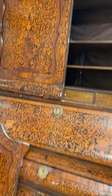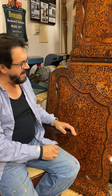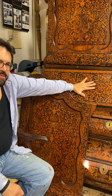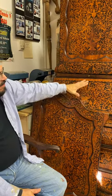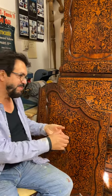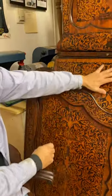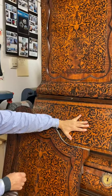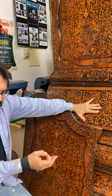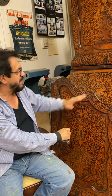The seaweed marquetry was one of the most intricate of four or five different marquetry styles done in the 18th century — by far the most complex. This substrate under the flap or lid was done with molding planes, shaped and formed. The piece of marquetry was done on a bench — the entire piece — then it was wetted and formed, bent over something, and pressed onto this flap that had been molded and planed, with hot glue, heat, and a lot of pressure.